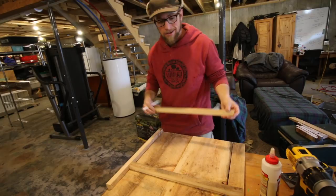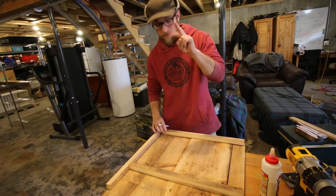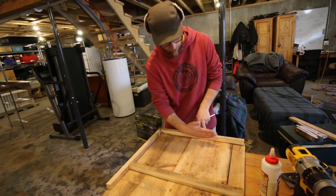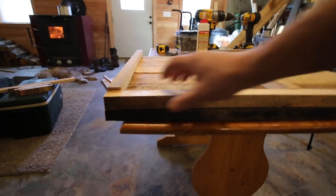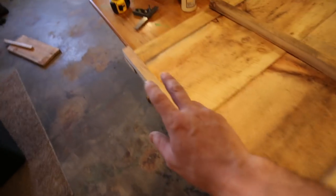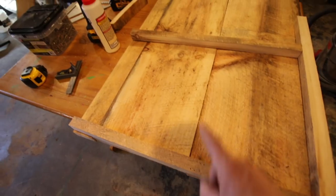Now we need to get our cabinet sides screwed and glued together. We're using our one-inch strips that we just ripped down - these are going to serve two purposes: they'll hold all of our boards together, and they're where we'll put our other boards to make our shelves so our metal bins can have a shelf to set on. The front of our shelf is going to be faced off with a piece of rough lumber, so I need to set our brace boards back from the front edge by the width of the rough sawn lumber. I also need to pre-drill and countersink all of these - being only an inch wide, if I don't pre-drill them they'll split, and we don't want that to happen.